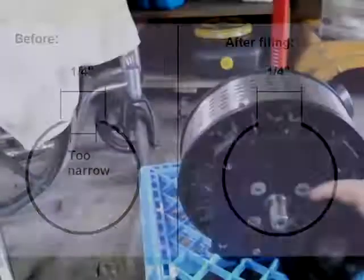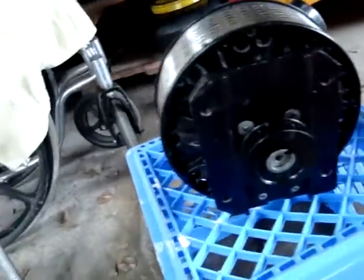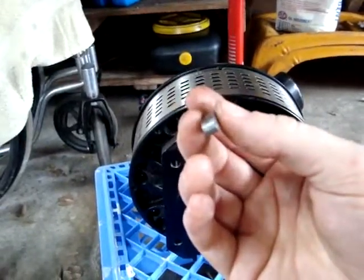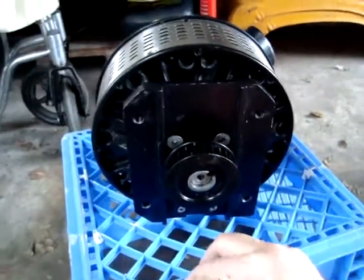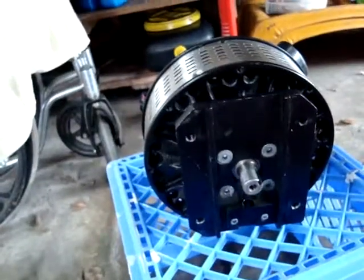Going back to this motor then — I've got the sleeve, I've got the pulley, and now I need a keyway. Going back to the original keyway, this one's roughly square, a quarter inch by a quarter inch. It sits an eighth of an inch into the shaft and an eighth of an inch into the pulley. But what about that extra eighth of an inch? That's the thickness of this silver ring. So in all, you need a rectangular keyway — one that's a quarter inch wide by three-eighths of an inch high, so it can go all the way through all three components: shaft, sleeve, and pulley.